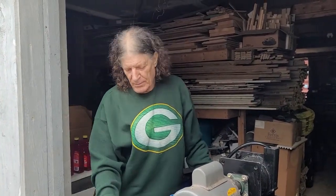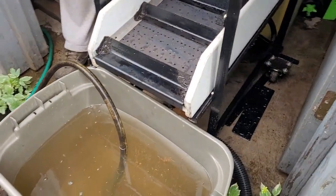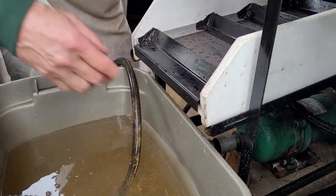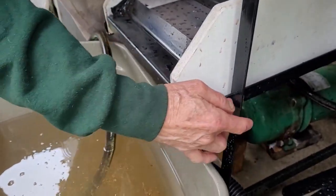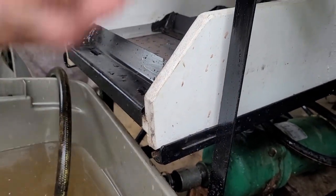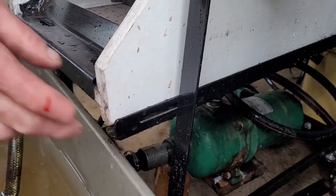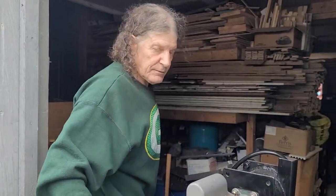We're back. We modified the slope on this sluice. We've got a system of bolt holes, a couple of small bolts, and a slot in the rail so we can raise and lower it. We brought it back up to about four or five degrees, so we'll plug it back in and see how it runs.